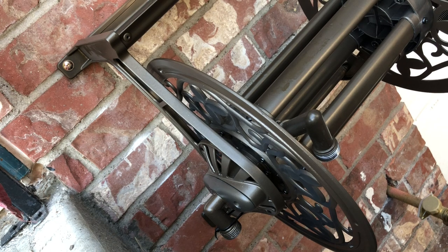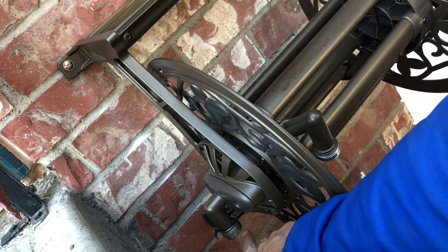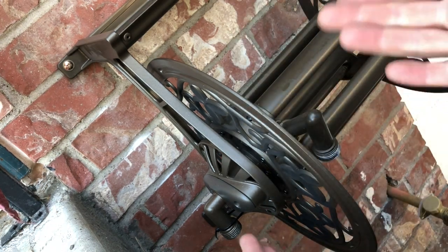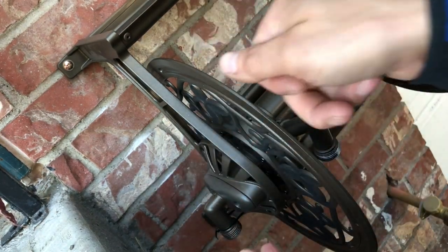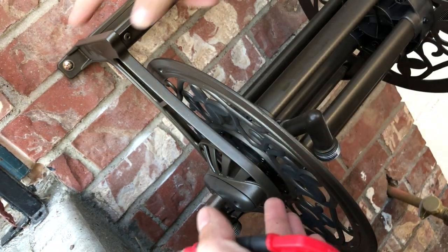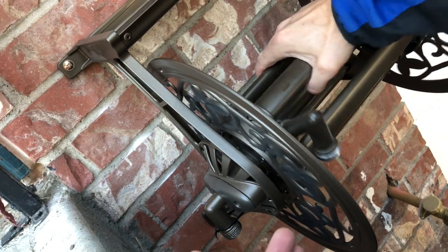All right, guys, so after a little bit of frustration and just messing with it a little bit, I actually was able to get these brackets to work really well, or the anchors, the plastic anchors. This bottom one down here actually wasn't even lined up all the way. I had to kind of finagle to get that one in. And I drilled it based off of that template that it came with, and it still wasn't really lined up. But after I got that one to go in, after pushing it up there, hitting it at an angle, it went all the way in without twisting the plastic anchor in there, which actually put pressure on all the other ones there. And then I was able to drill in those without them spinning. So I was able to get it nice and tight. Sucker's on there really good.